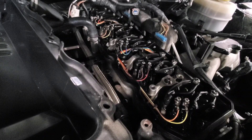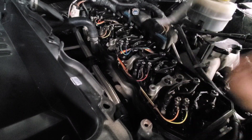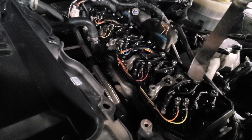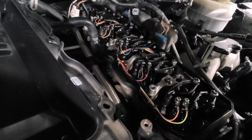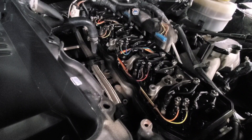But if you've done valves before, you know that feel you're looking for. You just want that little bit of drag so it pulls through — you want to feel it. There is a range on these, but .010 for intake and .020 for exhaust. That's coming straight from Fleece. Fleece is the one who built and did all the work to this truck, so I'm going off of what they say to do for it.